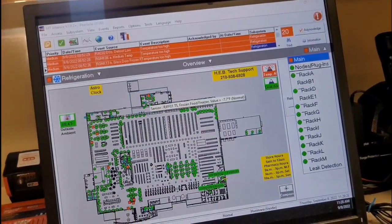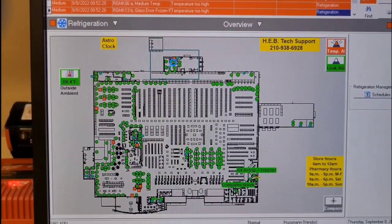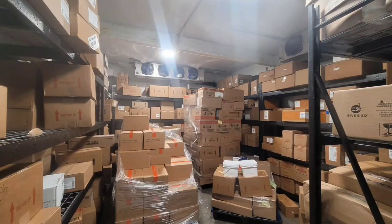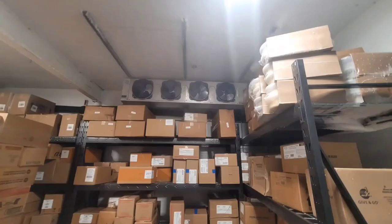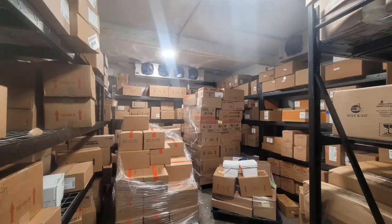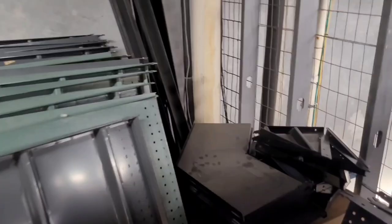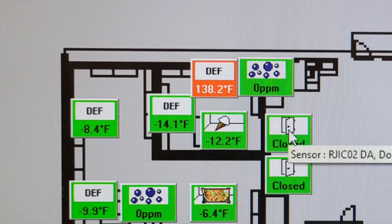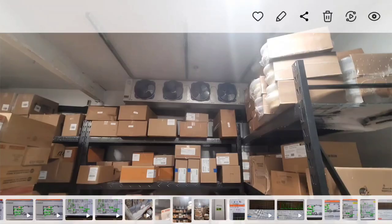When I get there, this is what the computer looks like. They've got a bunch of alarms everywhere for other stuff, but I'm focused on the receiving area where the sensor in red says the evaporator coil is at 137 degrees. In the freezer, this is the coil to the right when you walk in the door, and the other is straight ahead. On the computer screen, in that little freezer in the middle, we've got a temperature sensor — that's the ice cream cone icon — and the ones above and to the left are two different defrost temperature sensors. One reads 14.1 and one is obviously way off, so I believe the right one is the evaporator sensor I need to replace.